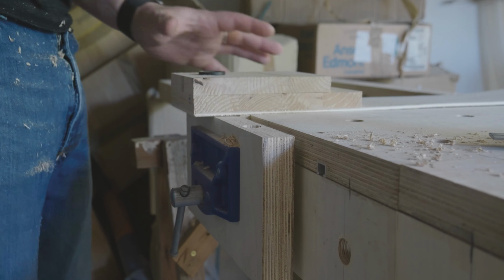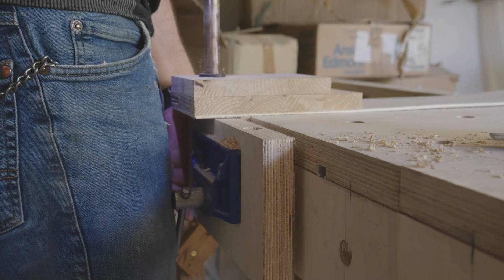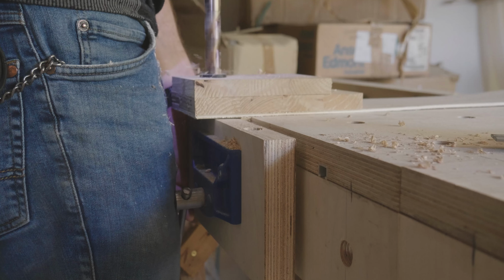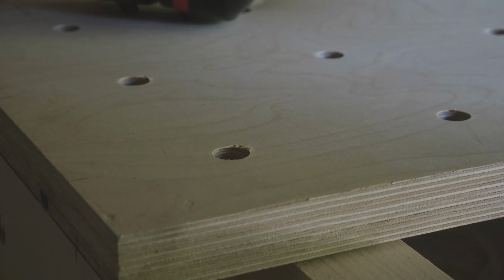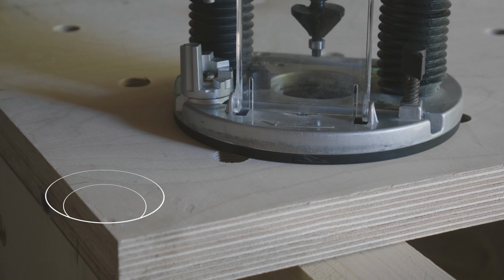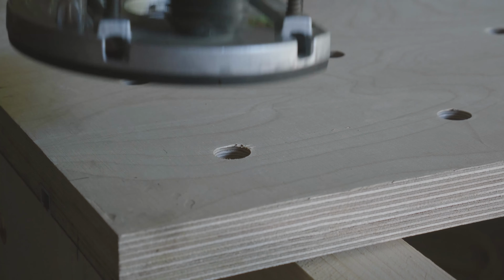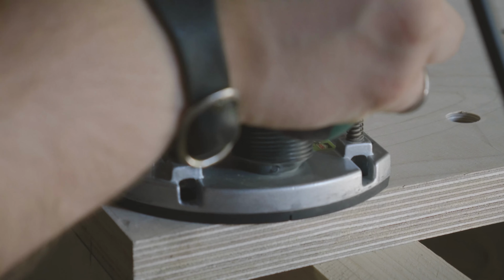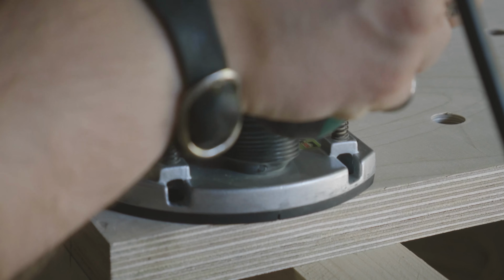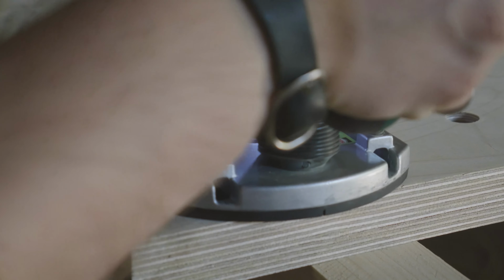The holes now all have a sharp 90-degree edge. This is now chamfered. With a chamfering cutter I removed the edge and replaced it with a small 45-degree edge. This looks better, it splinters less, but above all it protects the holes from being torn out during work. The top layer of veneer of the multiplex will otherwise peel off quickly if bench dogs regularly absorb shocks in the holes or clamps press against the edges.